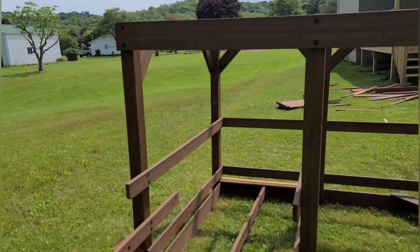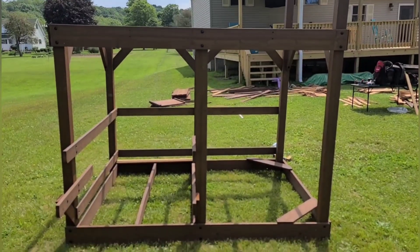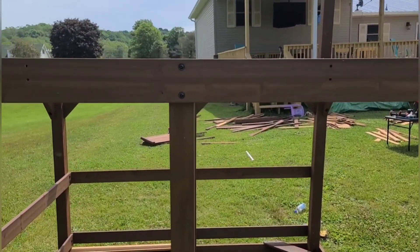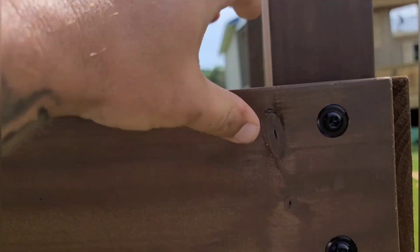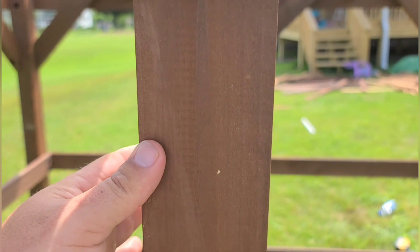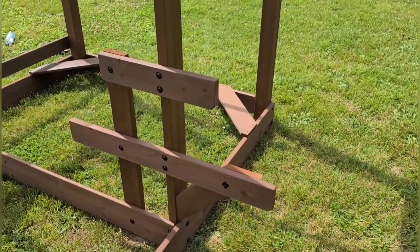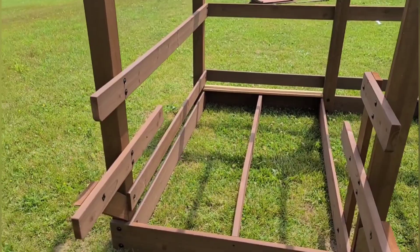This is the bench side, table side, and where your monkey bars come out - all the thicker boards. If they're bolts it's going to be three-and-three-quarters; if they're lags, two-and-a-half. Two thick boards together use three-and-three-quarters. If it's a thick board with a thinner board, use two-and-a-quarter. Your middles get two-and-a-quarters. When you have to switch up, those are one-and-three-quarters with t-nuts, and two-and-a-half for lags.